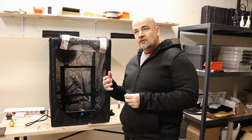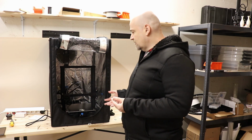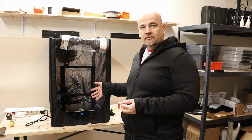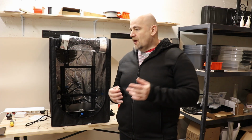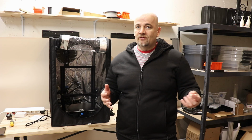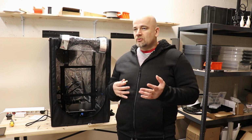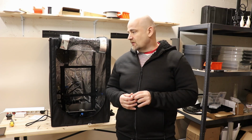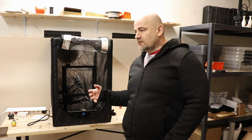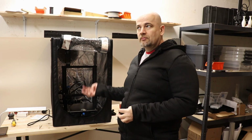Because this hotend is able to print at even higher temperatures, but we are limited now to 260 degrees Celsius by the firmware of this Ender 3 V2. I'm not sure about the heating cartridge and the thermistor, whether they can handle higher temperatures, but it would be good to somehow modify the firmware, at least, I don't know, 10 degrees higher. Theoretically, the firmware upgrade on Ender 3 V2 is very easy because it has its bootloader.